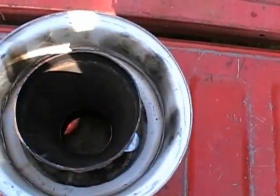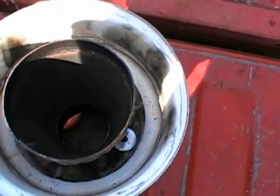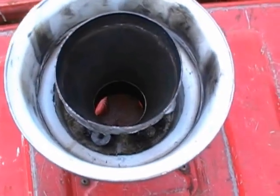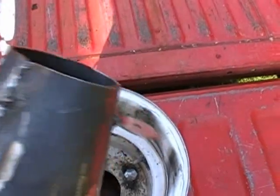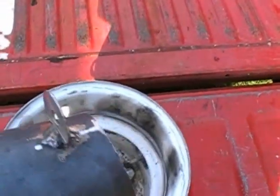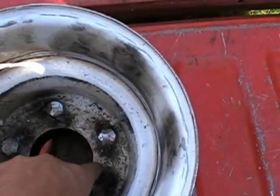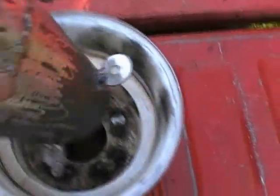This is so when you set this guy in here and you pour your mixture around it to seal everything, those are like anchors. That's just a little bit of peace of mind that your cone isn't going to come loose and come out of here, which it won't anyhow, but basically once the stuff hardens, it's not coming apart. So be sure to add something like this at the bottom of your fire cone, and be sure to raise them up from the bottom enough so that they don't hit your bolts, okay? Just be sure to have enough space on there so they miss everything.